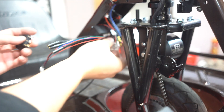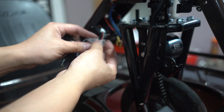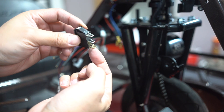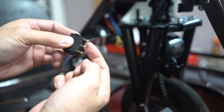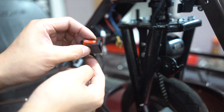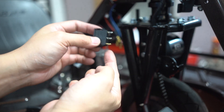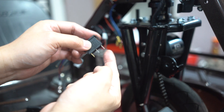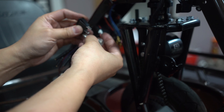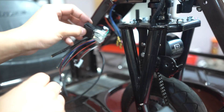When installing the power switch, you'll see on the power switch connectors there'll be 3 wires: a red, green, and a black. On your power switch you'll see there's a copper looking connector and the other two are silver. The copper one will go with the black wire, and this is only for the light to turn on when you turn on the power switch — aside from that it doesn't do anything else. If you decide not to have the light turn on, the only things you'll need to connect are the red and green wire on either of the two silver ones.